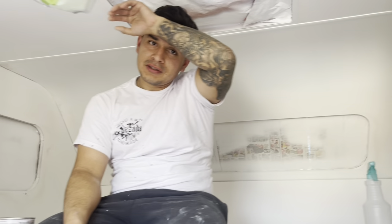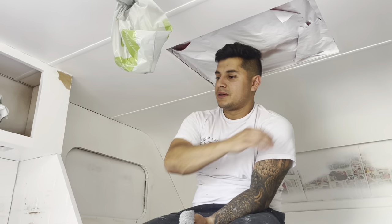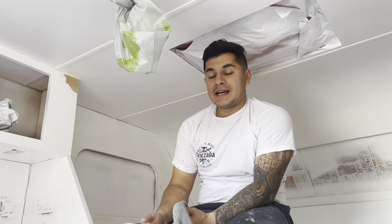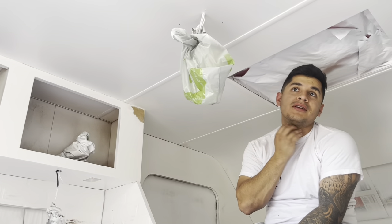The spots on the sides — really bad yellowing. So note to yourself and anyone else doing this: just use oil-based primer. I went with water-based because I thought it would be easier to work with and assumed it would perform the same, but after this screw-up and more research, oil-based primer is stronger and you can paint with basically any paint over it. Just stick to oil-based primer.